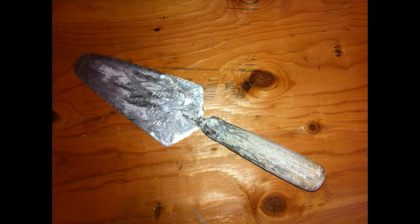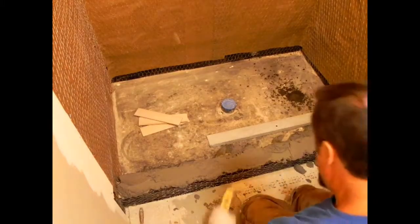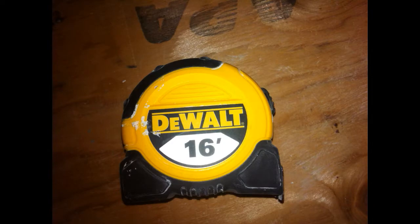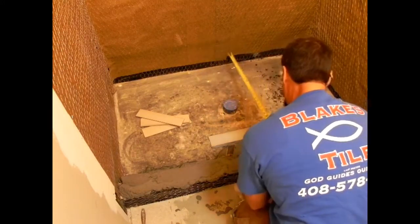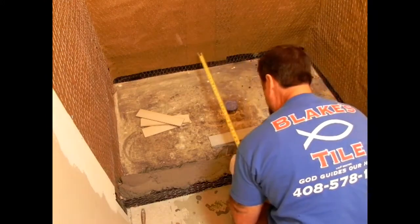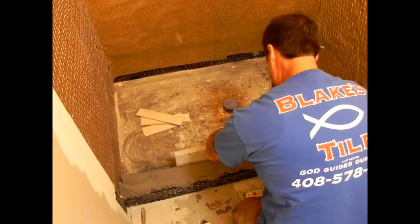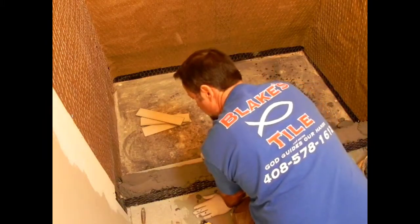What I'm throwing on the curb here is some fat mud. Then I'm going to take these quarter-inch by one-inch by six-inch sticks with my torpedo level and plumb them up. I measure from the back wall to get the same distance with my tape measure and make sure they're the same. The reason I'm putting them so close together — normally you want them further apart but I only got this little metal edge, I think it's a three-footer, because my four-footer won't fit in here.